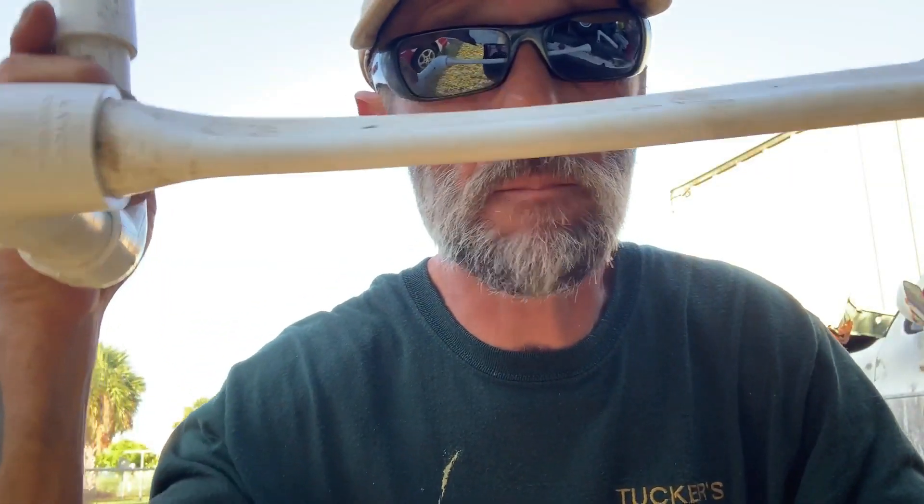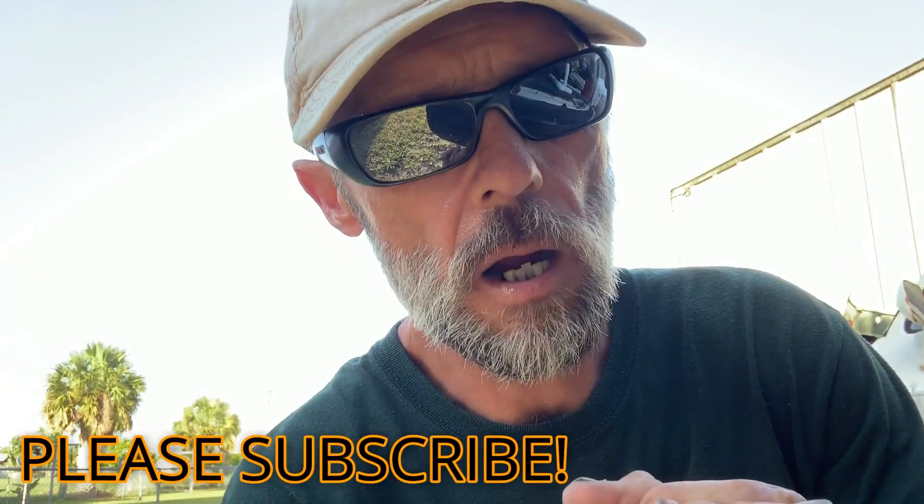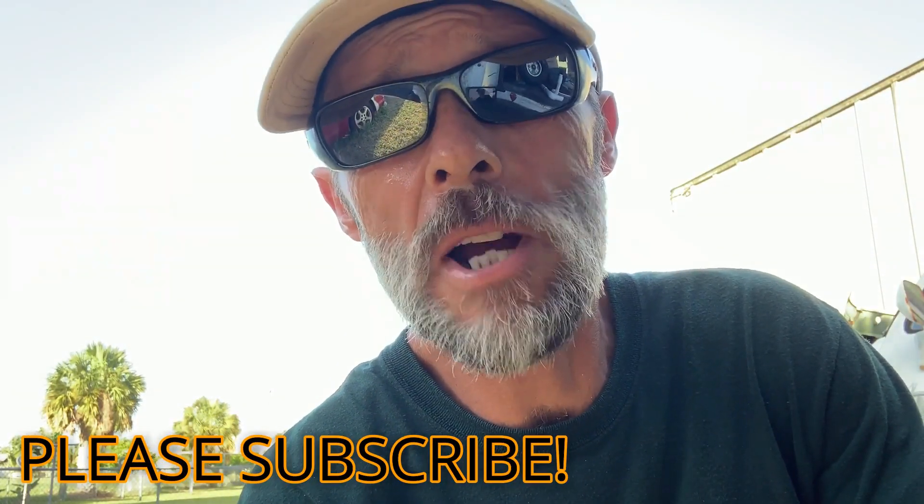Hey, that's all the time we've got for today. I appreciate you guys stopping by and hanging out. Got any questions or comments, please leave them down below. Out of all my years of plumbing, I've never seen a piece of pipe get sucked thin like that — I've seen it swell up from heat, but not like that other piece of pipe. So make sure if you're going to have work done on a pump, get a professional licensed plumber that knows what they're doing, and follow the steps I showed you on how to disperse the heat with the galvanized nipples and heavy duty Schedule 80 fittings. Thank you so much. Until next time, it's been Plumbing with Tim — keep plumbing.